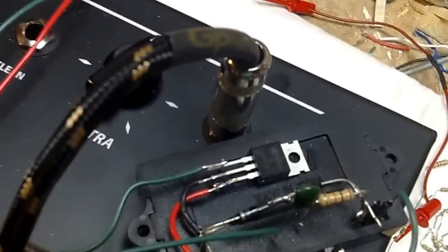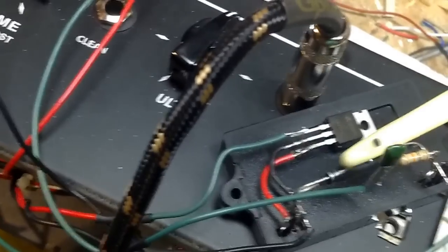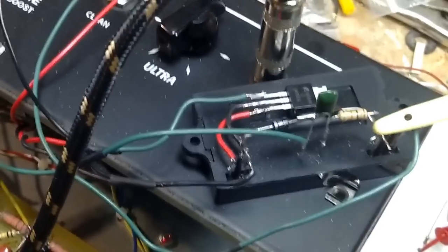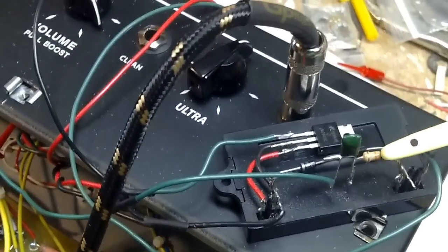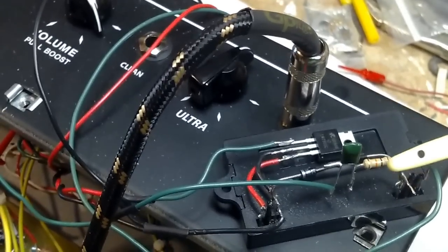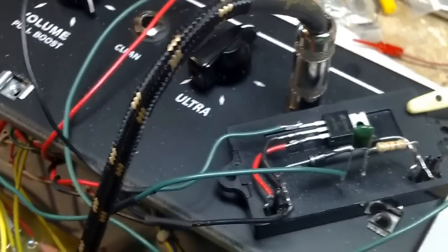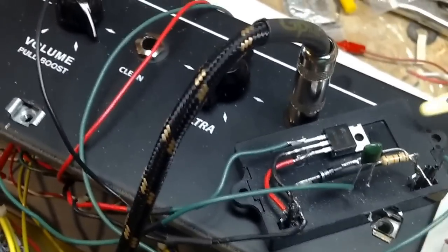I may have done some damage to the Belton input, but it still works. So what I've got in here is a couple of diodes to bring it down to about one volt — two series diodes and then in parallel two other series diodes — which clips the signal at the input to one volt. I've got a 10k resistor for input impedance and a 0.01 cap. You need to work out the filter effects of that cap and the series resistance. The idea is you want to keep it above 700 Hz; below that you'll get a lot of distortion because it's just too much bass. Anything below 700 Hz isn't really beneficial for reverb anyway, and if you keep it above that it'll work really nicely.